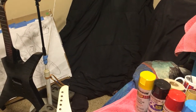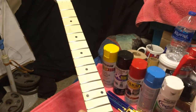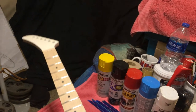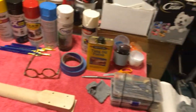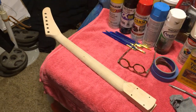because it does have a color to it. But yeah, I'd rather have it treated, especially on the front, because I don't want any finger marks, not even a little bit of shine to it. And I am going to do the inlay with the fingers, the Angel playing on the guitar right up there. So I'm going to do this first. All right, let me get the tung oil ready and get everything going, and then I'll put a layer or two, and I'll catch up with you in a little bit.